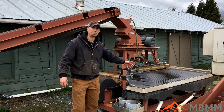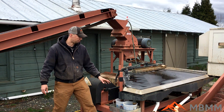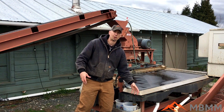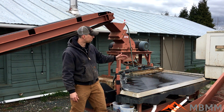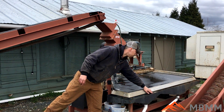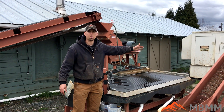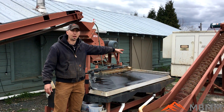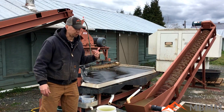It'll come down onto the shaker table. The iron and the heavy material is going to come across the shaker table into ports one, two, and three — because we have so much volume that is iron, it's going to be pretty dense. The silica we're going to try and split off with the splitter down into the spiral classifier. We're going to dewater the silica and capture that, and then only the very fine stuff is going to go into our tailings pond, where we can recirculate the water.